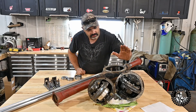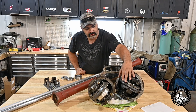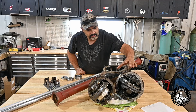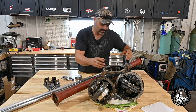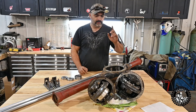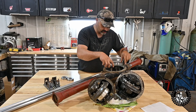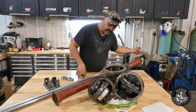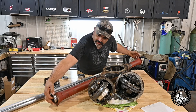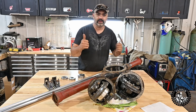What we need to do first is take apart this Sidekick third member — this set of 430 gears that I've got. We've got to mark the gears where they're at because we're going to be putting the locker back into this. We need this third member to drop in here with the pretend bearings so we can run our shaft all the way through and get it straight. We'll take this apart, set these bearings in, drop it in place, bolt it down with a couple of bolts, run our shaft through, then put our wheel bearing caps on. Hopefully they just go right in where they're supposed to. If not, I'll cut these tacks and adjust the tubes where they need to be.